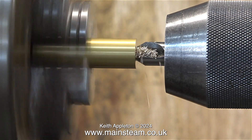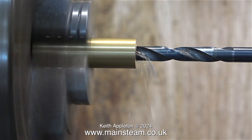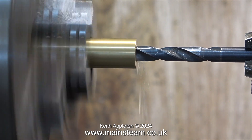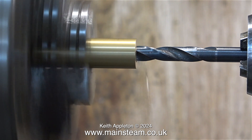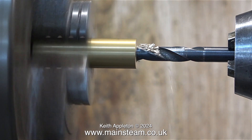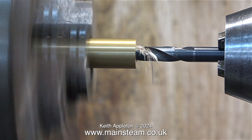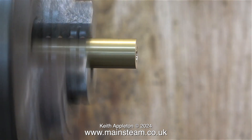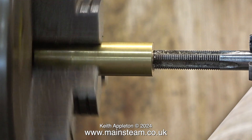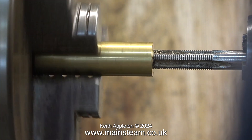It's a very simple part. As always I start the job with the centre drill, followed by a twist drill which is tapping size — in this case for 5/16 by 32 threads per inch. Brass machines nothing like stainless steel — it cuts like butter, is very easy to use, and doesn't get too hot. Sometimes when you drill or thread brass it does squeak a little bit, but that's not really a problem. It's not often that I use any lubricant when cutting brass.